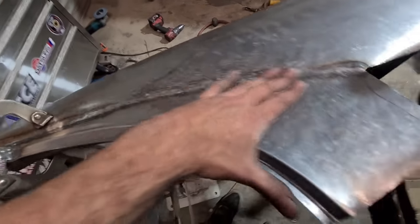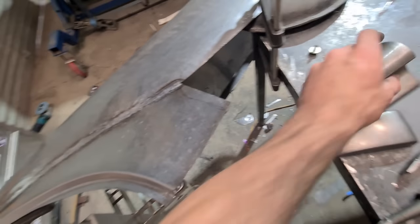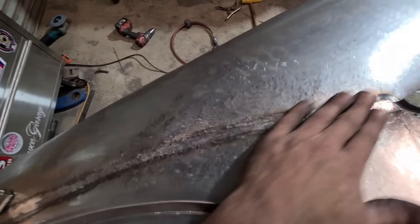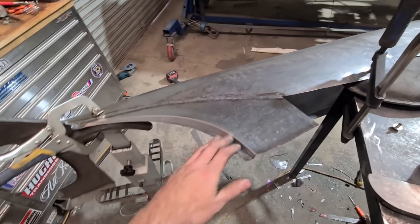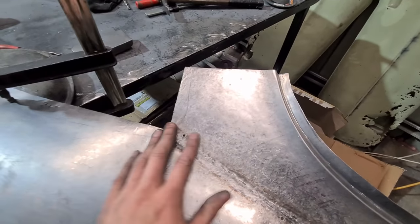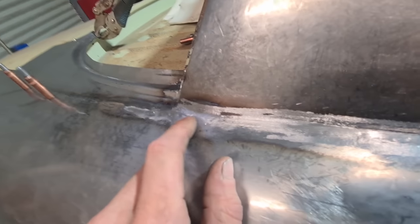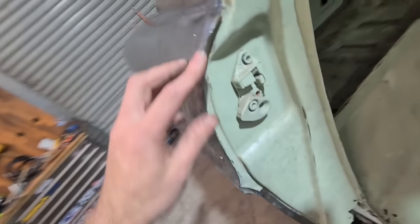It's a tricky little area because it's such a little skate ramp — I knew once I welded this it was going to shrink and pull upwards. I'm using a combination of the appropriate dolly for up top and just a high crown with the flat bottom — if I get it too high I just stretch that weld right back out so it really dips in and flows nice. I'm pretty happy with the blend of the join, it's just starting to ramp up a little bit here, so I'm going to chuck it back on the car and see what this area needs. I need to remove it again just to bump up a few little lows, and planish this blend up a touch more.